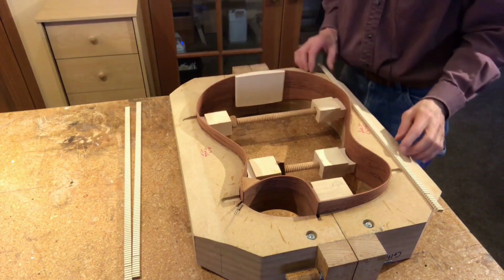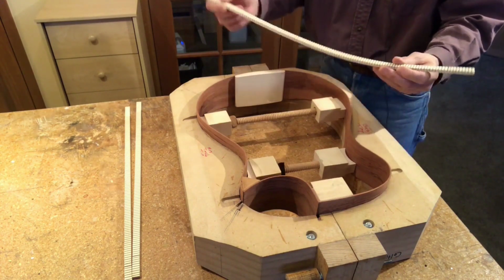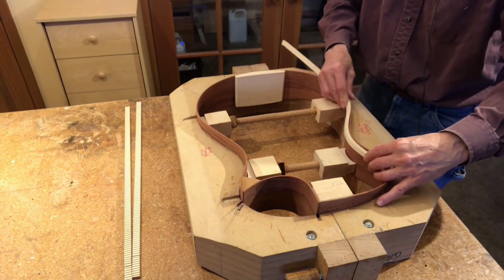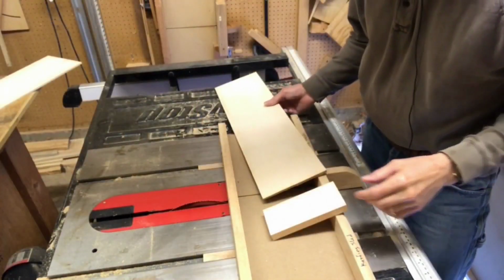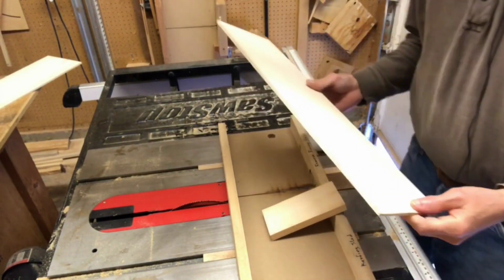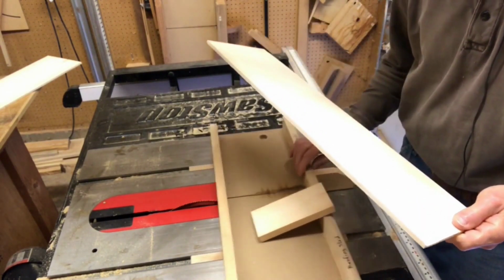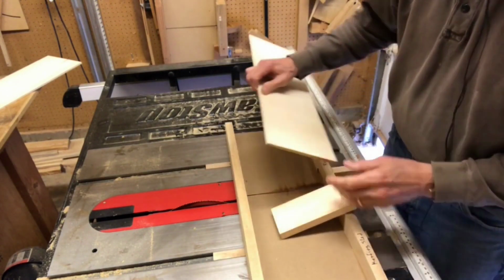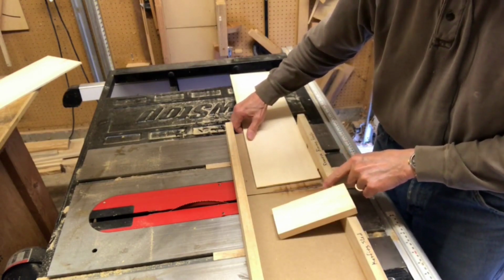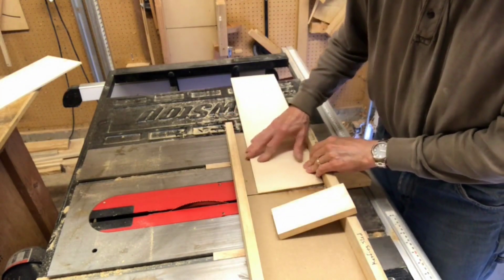In order to provide a ledge on which to glue the back and top, this flexible kerfing or lining is glued on along the edge like so. I use reverse kerfing. I make the kerfing from quarter sawn Engelmann spruce from Colorado on this dedicated sled and blade that I ground down to a 1 millimeter curve. Just making repeated cuts, engaging the little tooth on the sled for even spacing. Almost, but not quite all the way through, so that the wood becomes flexible.